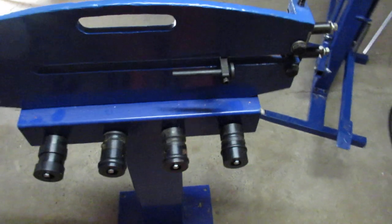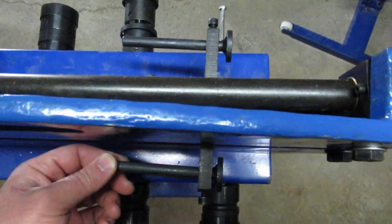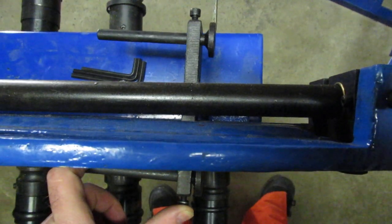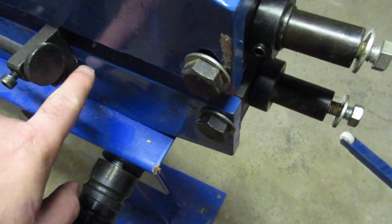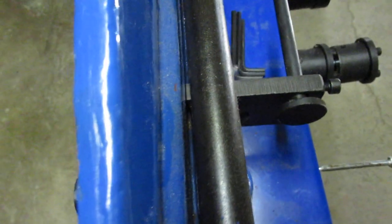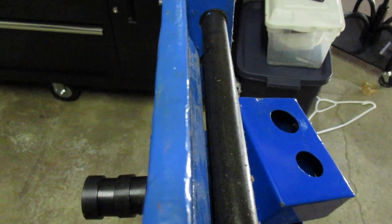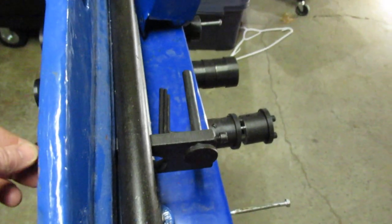As I was putting this thing together — actually I had put it together a couple of years ago and just relocated it to where I'm working now — I couldn't get this depth gauge to work originally. We kind of had it sitting aside. I started working on it today and it seemed like it was the wrong size and wouldn't fit. So I did some machining on the part that slides over the bead roller to make the space a bit bigger, and I realized I would have to take the thing down to nothing and it still wouldn't work. Looking at it closer, you can see the cast iron is bowed — I put a straight edge across the back and it's bowed about an eighth of an inch. That is the reason why this depth gauge doesn't fit.